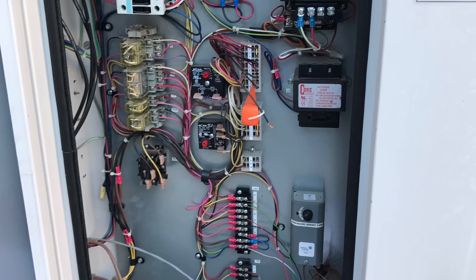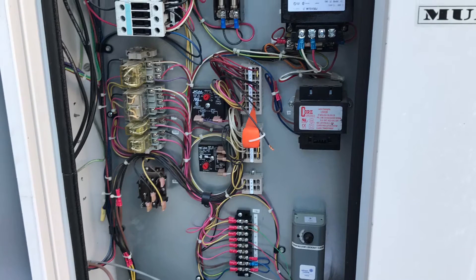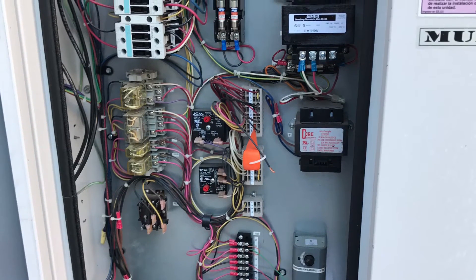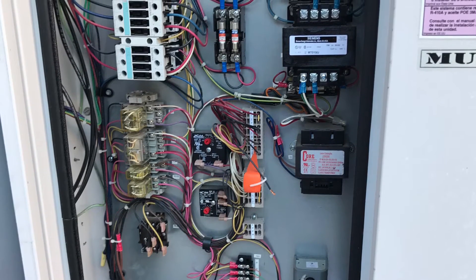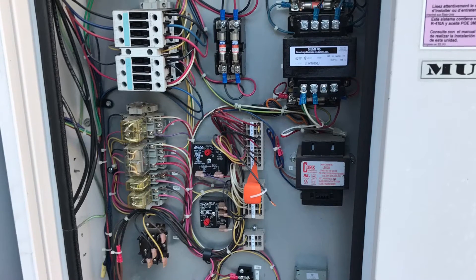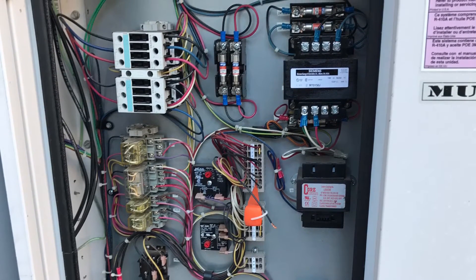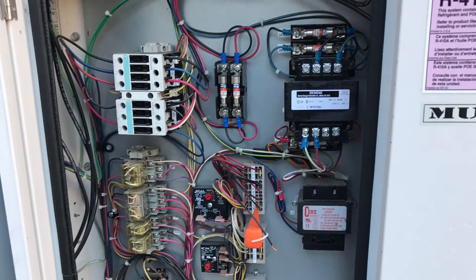It's designed to bring in 95-degree outside air. According to the paperwork, your delta T for those conditions will be around 30 to 40 degrees across your coil. So say you're bringing in 100-degree air, you'll probably be getting around 65-degree air coming out.